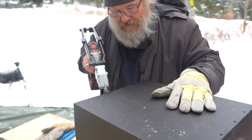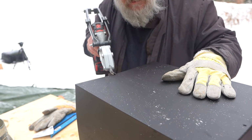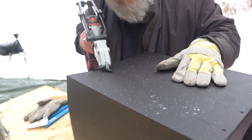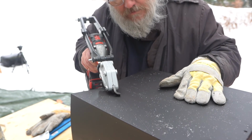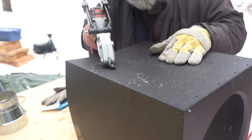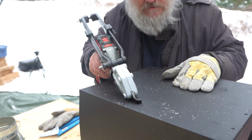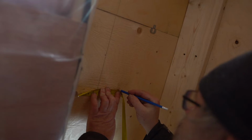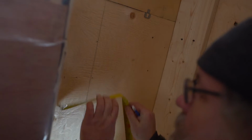With the stove itself, one other thing that I ended up picking up was the SuperVent Cathedral ceiling support kit. I essentially just used the chamber that they provided as a tertiary chamber, separating the insulation and the wooden studs from any combustibles coming off the tent protector pipe, which is sort of my secondary insulator, and then of course the original 2.5-inch pipe that came out of the G stove itself.